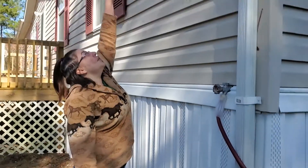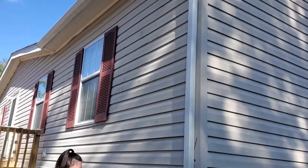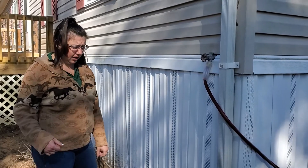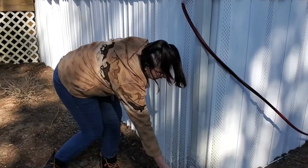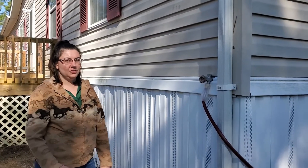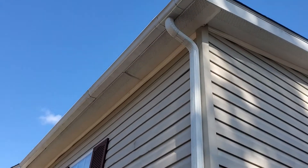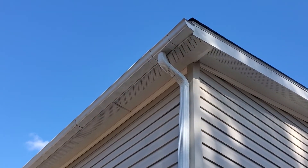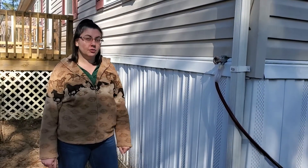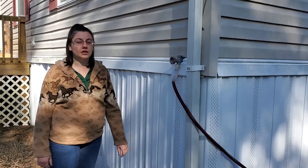You've got the gutter at the top and it comes down here. Sometimes people will take a leaf blower and blow it up into the spout — you only want to do that if it hasn't rained in a little bit because you don't want water to come down into your blower. You can also get on a ladder and go up there and check that your gutters are clean, especially if you have trees over your house, because anything that falls onto your roof goes into your gutters and they get clogged up. It's really good to make sure you clean them every so often.